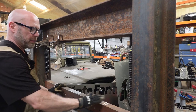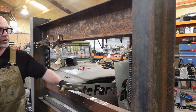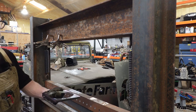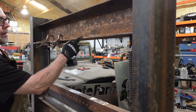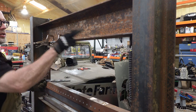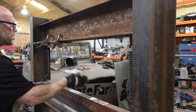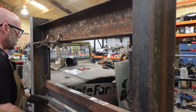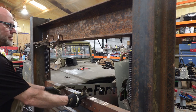All right, so you can see that we've removed the air over hydraulic jacks that were here. We've cleaned up our space, got everything out of there, and we've got one of the rings clamped up in place. What we've done is we've got the center location of the ring and 1/3 of the distance across here in order to make sure that we have equidistant spacing on the rams. Now, with that, that actually puts the rams closer to the edge than it does the center.